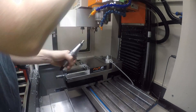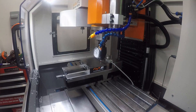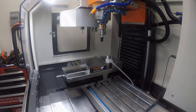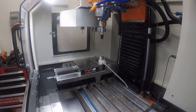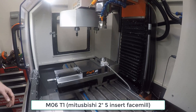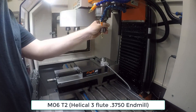I do a little switch to make connectivity. They actually work if there's coolant in the bearings. What I've done is touched off the touch probe against the tool setter, because that's rigid. Then I can zero my Haimer. Up in the corner you'll see me writing down some numbers — the difference in length between my Haimer and the touch probe — so I can use that information to set the appropriate default offset for all the tools. I double-check my math, and once I'm happy with the number, I can go through and touch off all my other tools.